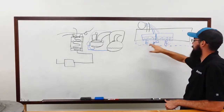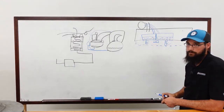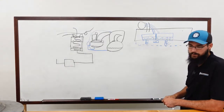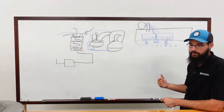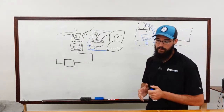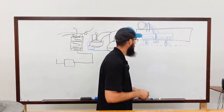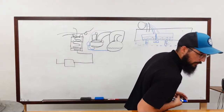So from there, you have three stages of flashing, one, two, and three on that style system. I think the CVHEs, I could be wrong, but I'm pretty confident they're a little more efficient. They're definitely more expensive. But I think where that third compressor comes in is they have better lift capabilities and higher efficiency, spreading the refrigerant load across the three impellers instead of two. If somebody has some input on that, feel free to throw that into the comments.